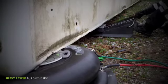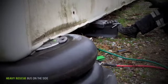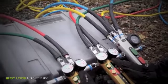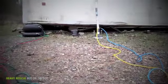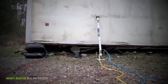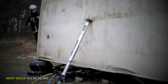During the lift, the Resqtec can follow the load upward in the beginning. Later they will be replaced by Profix Max. When using Profix Max to follow the load, you only need one man to control the whole operation. Due to the locking mechanism of the strut, it's impossible for this bus to bounce or to fall down.